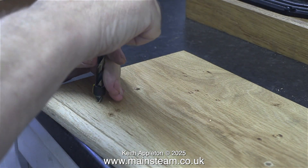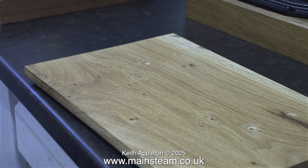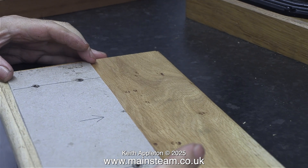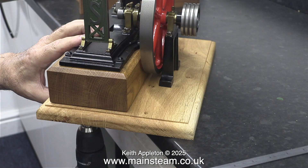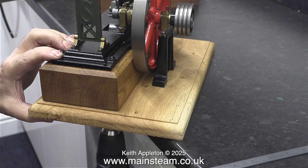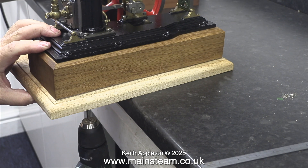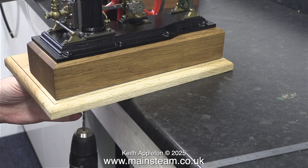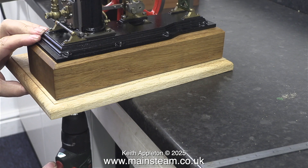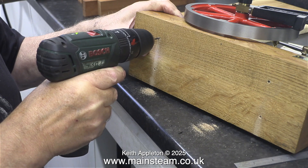To make this job successful I cannot have burrs either on the baseboard, underneath the wooden block the engine sits on, or on the piece of card. I have also used the same size twist drill to countersink the underside of the board to take the heads of the wood screws. I am checking the alignment of the piece of card — the good news is it's fine, although I'm not happy with the burrs around the holes in the card. Here I am drilling pilot holes into the wooden block from underneath — these are a good bit less than three-sixteenths and are pilot-sized for the wood screws. I drilled four shallow pilot holes which really needed to be deeper, so I am making them a bit deeper.